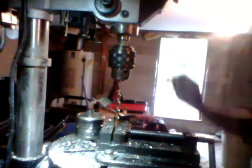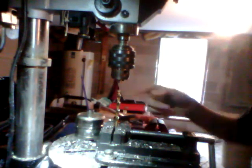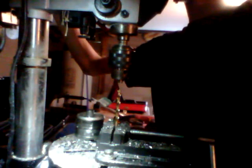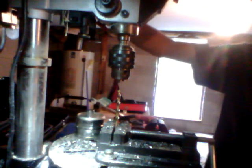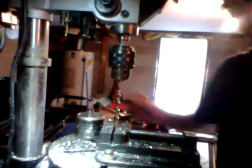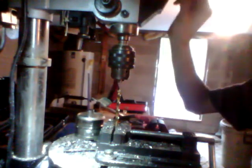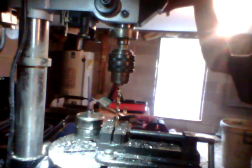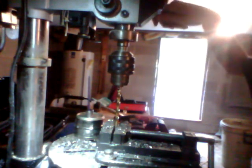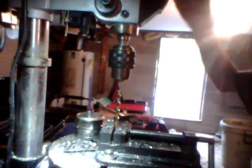We're good to go, ladies and gentlemen. You're going to want to spin this at about the same RPMs you'd want to spin your drill bit. We're at 2,230 RPM for a 7/32-inch drill bit. Put a little bit of oil on there and on the material. When you start, bring it down really slowly — let it barely touch and let it self-center with just a little bit of pressure — and just like that, it's centered.